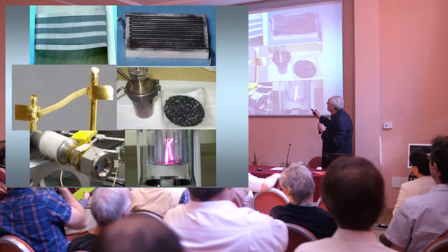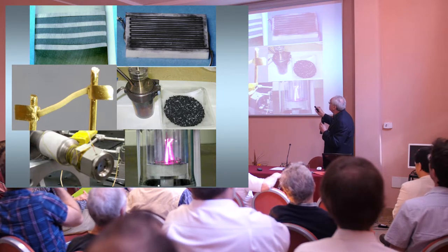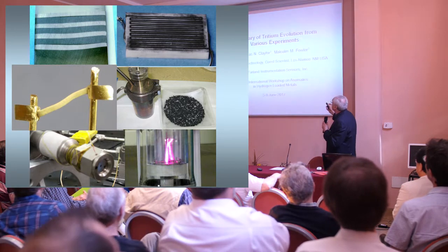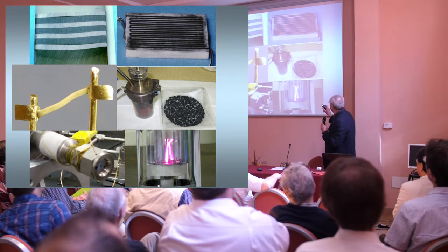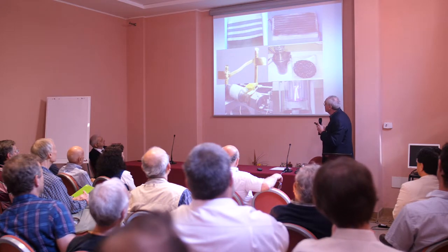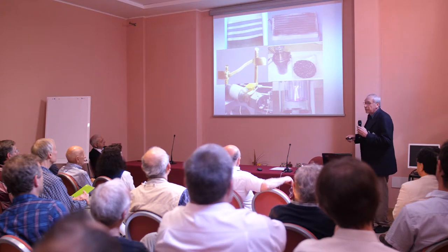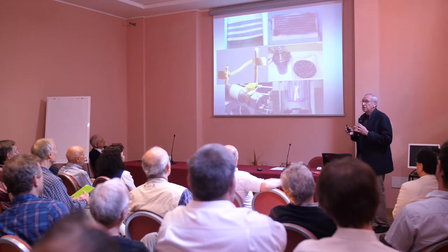This was the first experiments that we did with the palladium powder and silicon powder. Back to this one where we have palladium powder and tracks. Then we went to wires. The first wires we did were very thin wires — 100 micron wires. Those worked fine, but they didn't work very long.